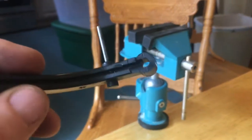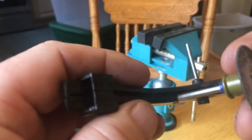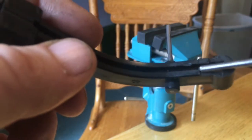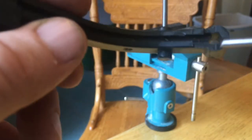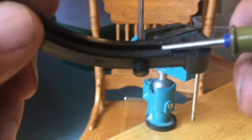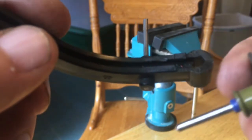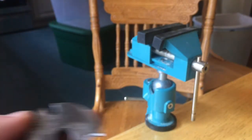This is the trough where the primer feed comes down. You can see where this one got messed up and dented — it doesn't feed well. I had another one where the leading edge broke off, so the primers would actually flip out that way. Usually if you get a clog you can clear it, rotate it, and the primers get spit out and fall through a hole in the carrier. That's the primer flip and primer feed problem.